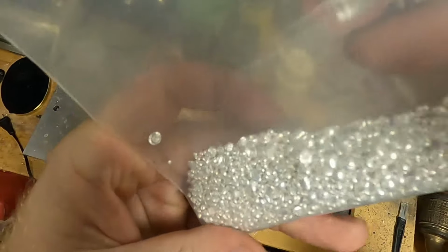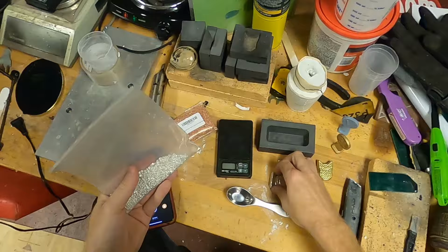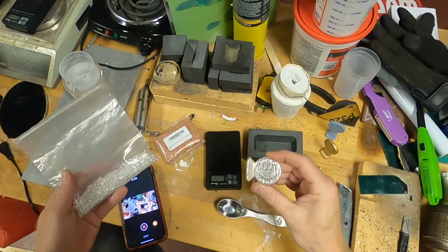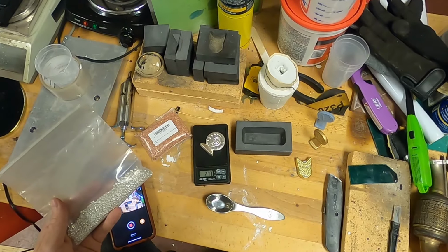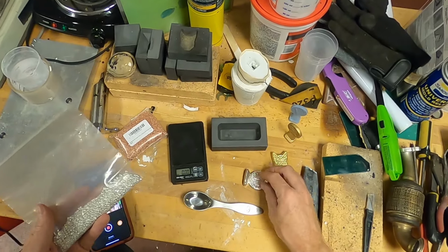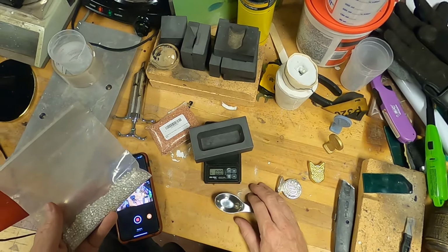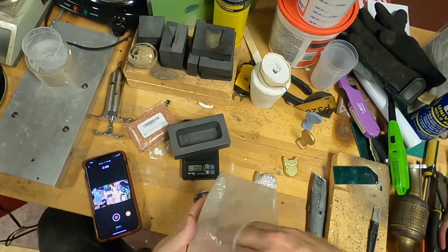It's about time, so I'm going to go ahead and take what silver shot we have left and measure it out. I'm going to use our good old 2020 COVID round as a metric, because I think it's a very similar weight. So see if I can get the scale to come back on. It's 2.73 grams. Of course, that has this feeder sprue, so I'll probably just round that up to 3 grams. I want to get something that's very close to the actual size and just pour the whole load in.